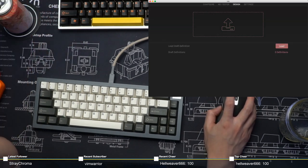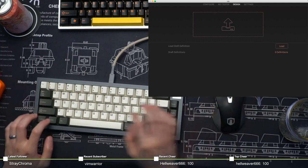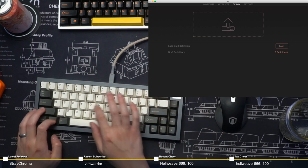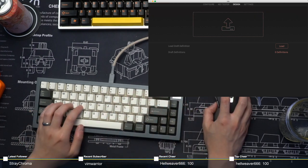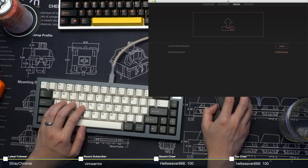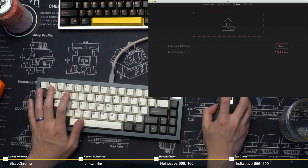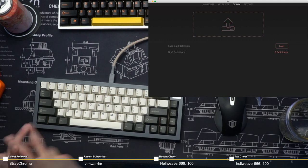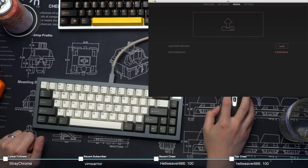So you click on design tab. Then you want to click on load. You then want to load that file that you just created. In our case, it's going to be the 1up keyboards file. Let's just look for it right there. You want to load up the 1up60rgb.json. And if you did this correctly, this is what you should see.